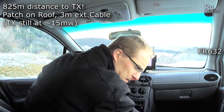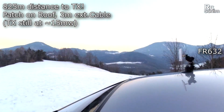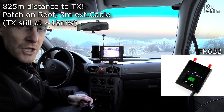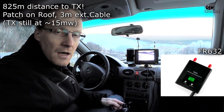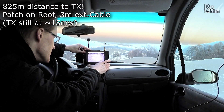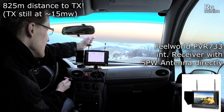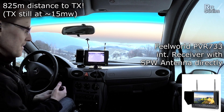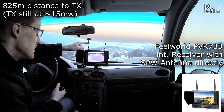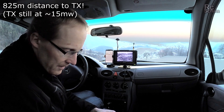I changed the antenna on the roof to a 13dB patch. We are 825 meters away, and that's truly amazing — we have not the best, but we have image. This shows in a practical application how antenna gain works, because the directional antenna now has 13dB. Just out of curiosity I switch to the other receiver — this is amazing. I barely get it with the internal module, this antenna behind the glass, but it gets some signal. So now with the directional patch on the roof, I'll cycle through my three different receivers.